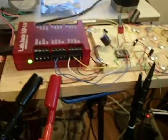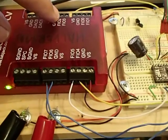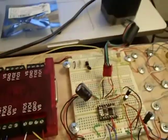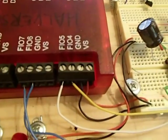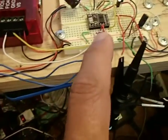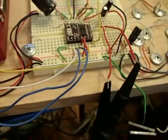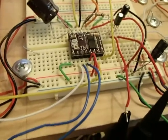Let me document how these wires are going. FIO3 is controlling the direction of the motor — I'm switching that back and forth when it comes to a stop. FIO4 is sending the steps; it's the output of the timer, which runs the pulse generator and steps the micro-controller. FIO5, 6, and 7 are the ones determining the size of the micro-steps. Right now I have it set to 1 0 1, so it's 32 micro-steps — one thirty-second of a step per pulse.